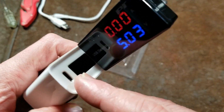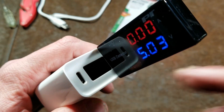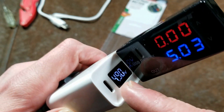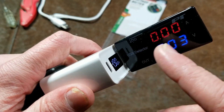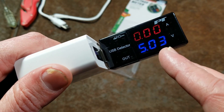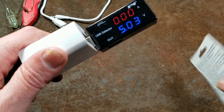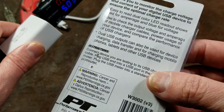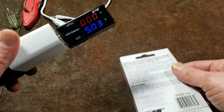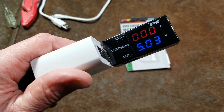When I got this charger, I have to plug it back in to get it to display its voltage. I actually butchered a USB cable and ran it through my Fluke multimeter to really see, and this charger is actually pretty accurate. This thing is a bit inaccurate, but it's within its advertised 1% tolerance — although you wouldn't find those specifications on the back of the unit or anywhere on the packaging itself. It actually would have helped them if they had designed better packaging to say that this thing is quick charge compatible.